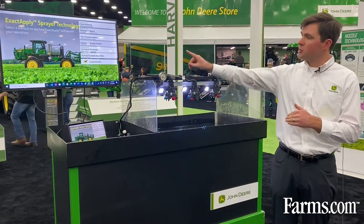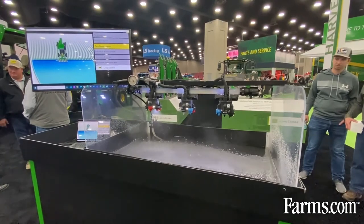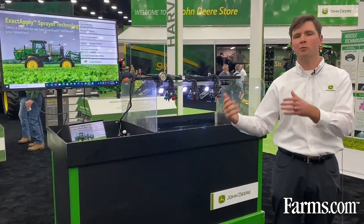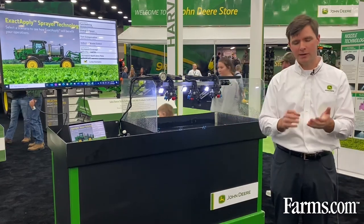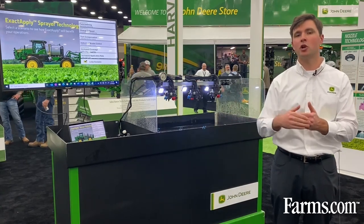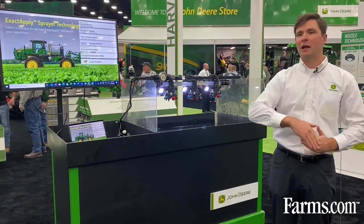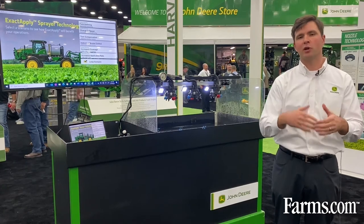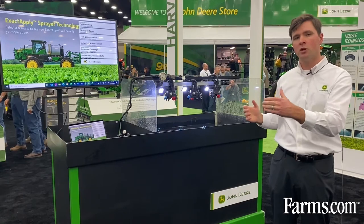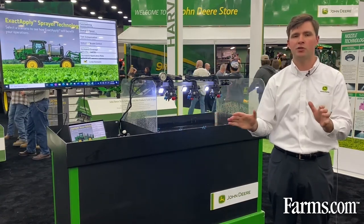As the sprayer is moving through a field — in this example the sprayer is going to turn to the right — if you look at the inside of the boom on the right side, it's almost standing still. The inside is either slowing down or standing still, and in that area we're overdosing — over-applying the herbicide, fungicide, whatever we're spraying. That can lead to crop injury and herbicide carryover issues into our rotational crop, reducing stand count and crop productivity. On the opposite side of the boom, the boom speed has increased, so there we're under-dosing and could see pest skips. The PWM technology allows us to alter the flow rate across the width of the spray boom for a more uniform and even dose, so we don't have those herbicide carryover or under- and over-applying issues in the corners of our fields.